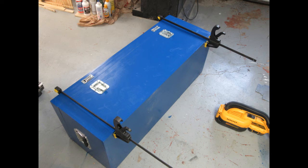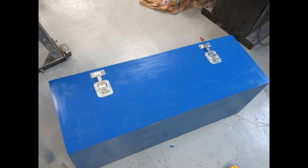As with the hinges, it is important to make sure that the case is closed tightly when fitting the latch keepers, so beam clamps are again used. The latch keepers are mounted to the lid of the case using sheet metal screws into the wood behind the masonite. The screws here are not long enough to extend all the way to the aluminum valance.